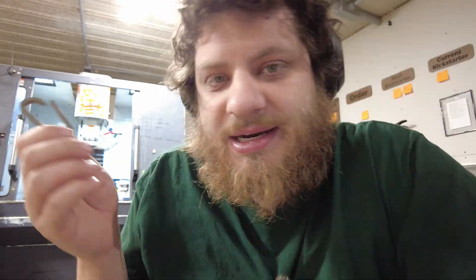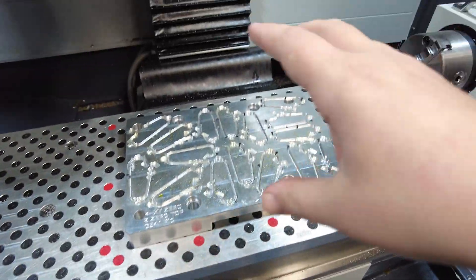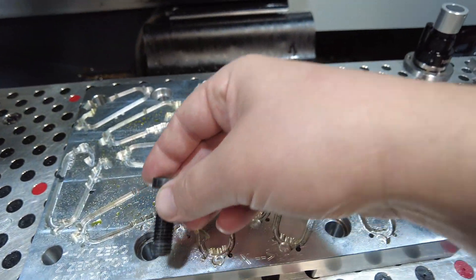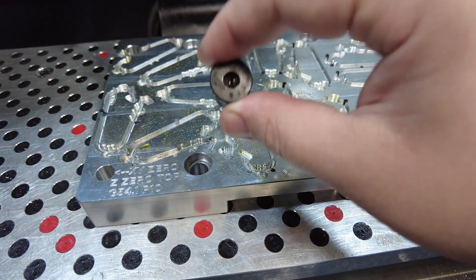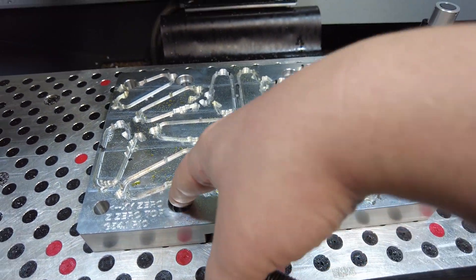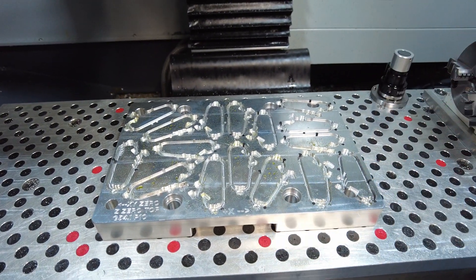The pallet is set up on the machine, held in place with dowel pins but no bolts yet. The first thing I'm going to do is make these countersinks deeper for my pallet bolts, because right now they're just barely below the surface and I need to shave off about a quarter inch. I don't want to face the bolts down, so I'm going to start by boring these out so I can fit my bolts well below the surface, then face everything off above them — hopefully without breaking any tools by hitting a bolt.